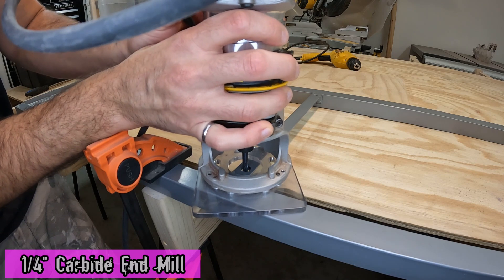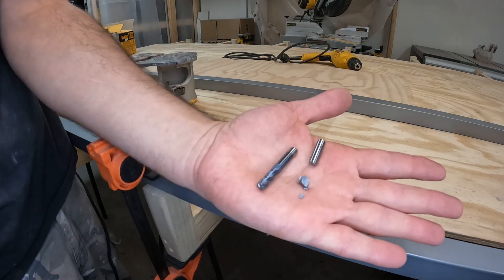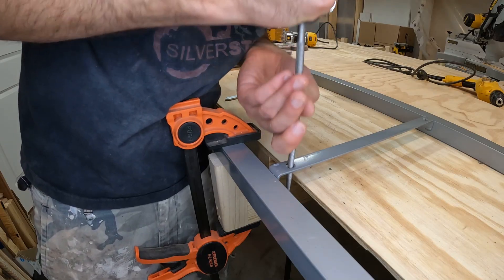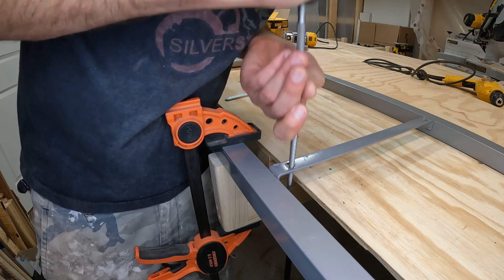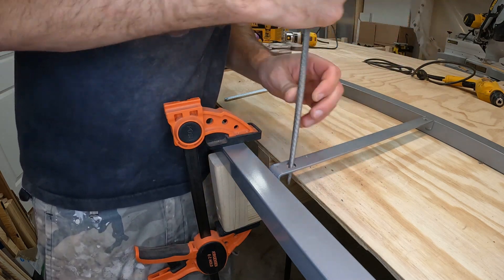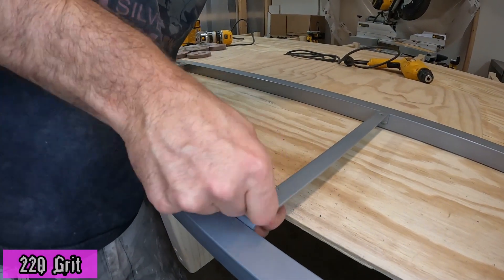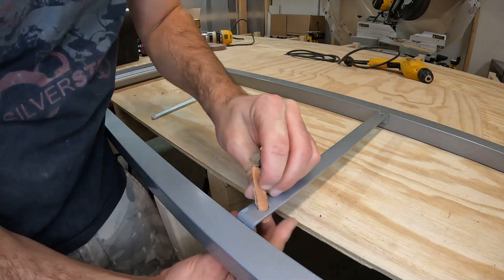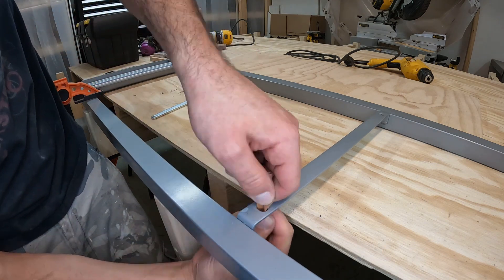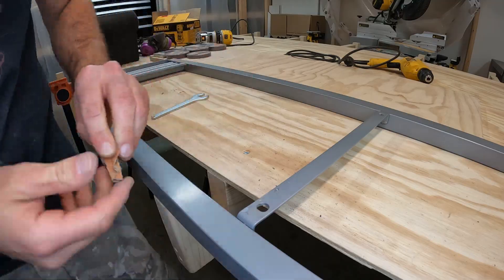I had done all the work and was assembling when I found one of my holes was just off center. Came back with the router and a carbide bit to try to open it up, but the bit snapped immediately — probably a little too much vibration, and those carbide bits don't handle vibration well. It's only a 1/8" bit so not a big deal, but I had to come back through with a circular file to clean things out. Then a little 220 grit to clean up the edge and corners so there's no roughness.